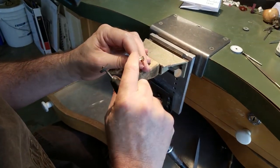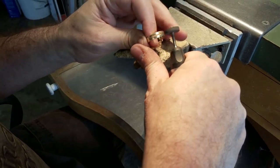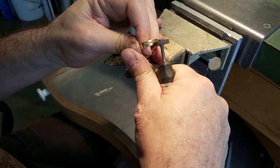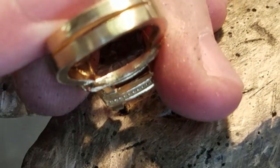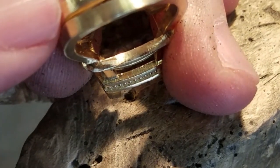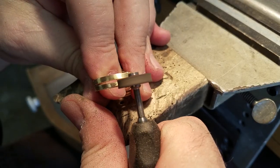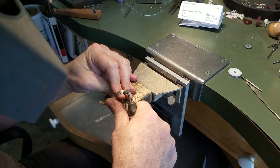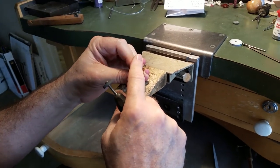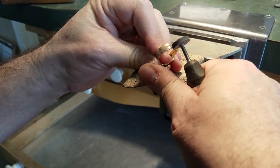This is perfect for the last blend here. You can see I'm using my thumb as a guide, going back and forth, and it's really starting to clean this up. On the top here is the one we filed, and we haven't blended everything. On the bottom is the one we blended with the Cratex wheel. When you're polishing at the bench, it's the time you spend doing the blending that's really important. I think a lot of people don't do this properly — the biggest mistake I see jewelers make, professionals and amateurs alike, is they jump right to polishing compounds.